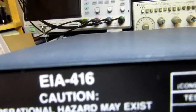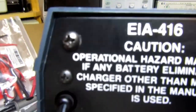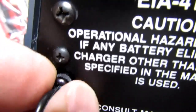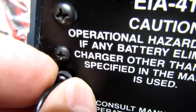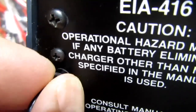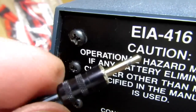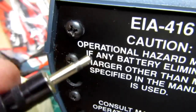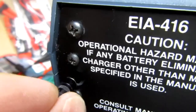And then that just plugs in to the back here. Now, because it's so recessed, you can't hardly grab the back of the plug housing, but thanks to those knurls that Switchcraft put on there, you can just get a grip, or you could just tug on the wires really, but it's safer to get a grip on the housing, and it is enough to reach. Then I'd mentioned that this is Switchcraft model 850X. That's 850X as in X-ray. It's a very common part, not too hard to obtain.